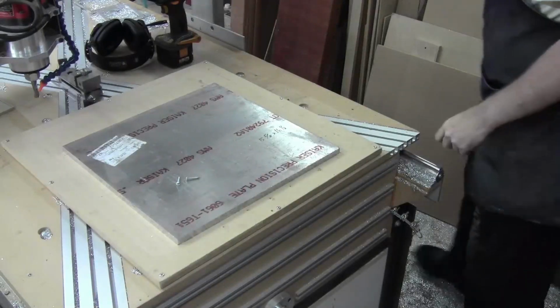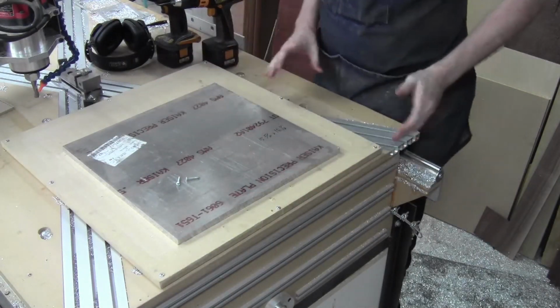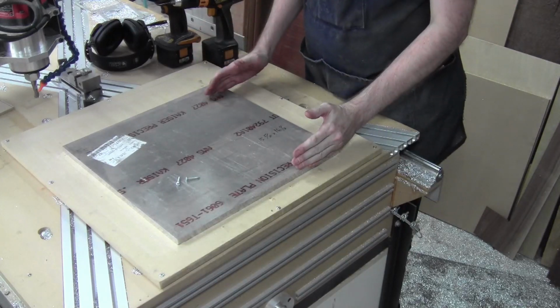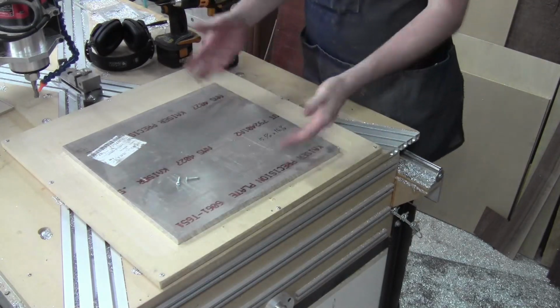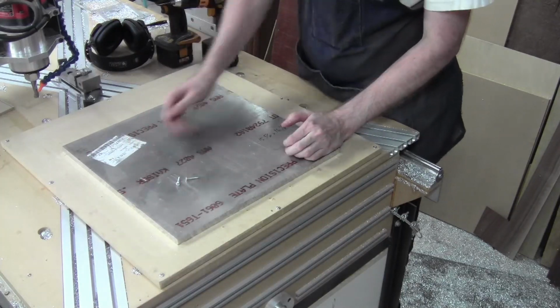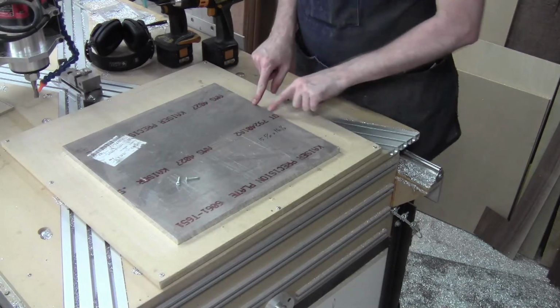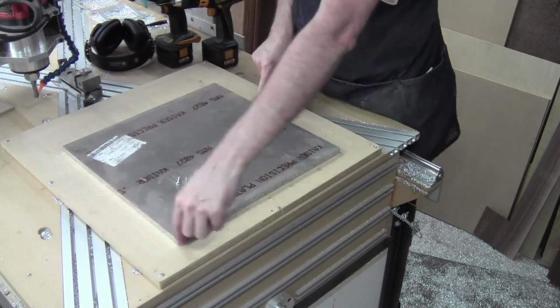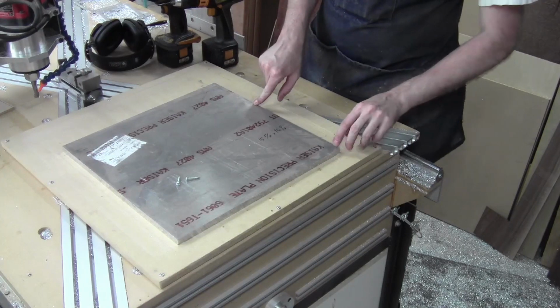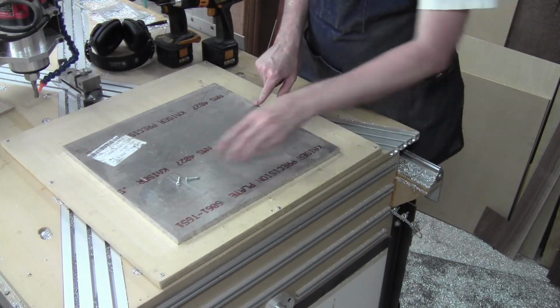Okay, last two parts. So these are tricky because basically the part is kind of a trapezoid or a polygon of some kind. It's got a diagonal. It's going to run on this part. It's going to run this way. I think the other part it's going to go this way. And it's going to cut away everything from these three edges, which means, ooh, we've got a really bad corner here that would suck to get an X and Y from.